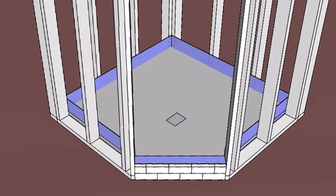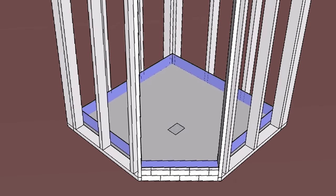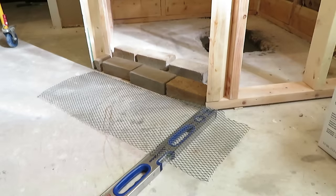Next comes another layer of the cement mix, which is called dry pack — I'll explain that later. This layer goes directly on top of the shower pan and again tapers down to the drain, flushing out with the top of the drain once the tile is installed. That's a quick explanation of the process. The rest of this video will deal with mixing and placing the dry pack and getting ready to install the shower pan.